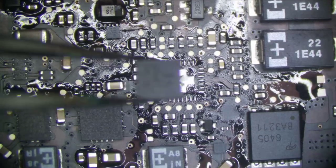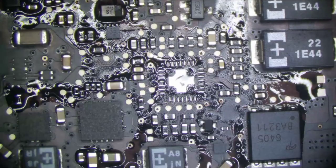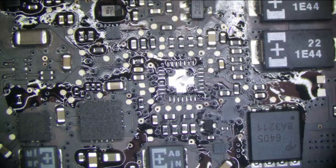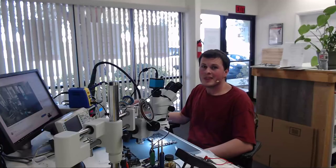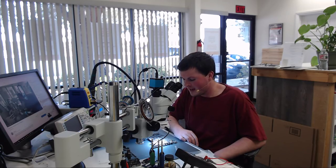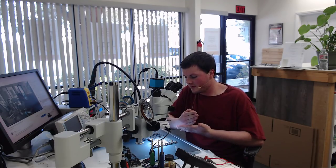Quick question. Does it matter if a MacBook is 14 to 20 volts, because different MacBooks? Okay, so yes. The working voltage, the absolute minimum that the system needs to turn on, is 14 volts, and the maximum before you start killing stuff is 20 volts. Now, the way the ISL works, it's going to take the charger voltage and switch that to 12 or 8 volts, depending on the machine.